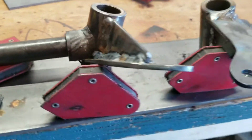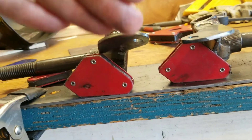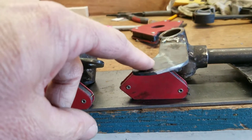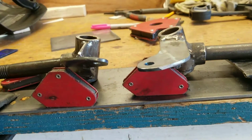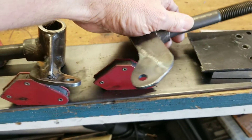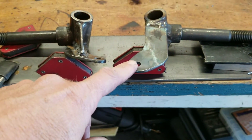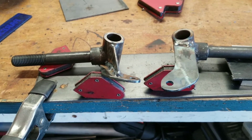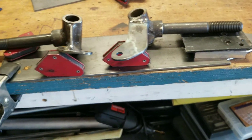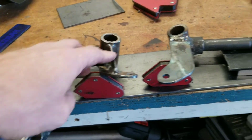Here's the new design — the plate is basically on top. In the old design the plate was on the bottom. You can see how much of a difference in angle there is. The old one is going two directions: that way and up, so when it interfaces with the tie rod it has a pretty wicked angle. This new one is relatively flat in two dimensions — flat right to left and front to back. The idea is that as the tie rod intersects it, as it pitches around the kingpin, the angle changes slightly through its arc but not enough to affect the spindle or the tie rod. There's 14 degrees of kingpin inclination built into these — that's why they don't look straight up and down. The point is to make the front tires correct the steering geometry.